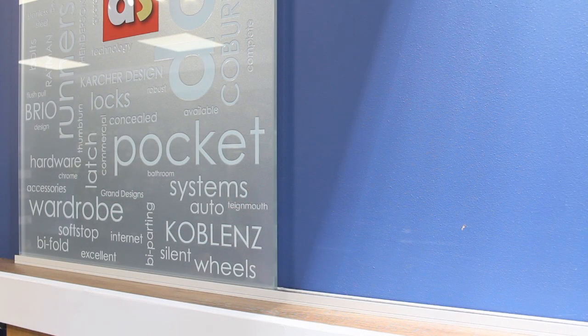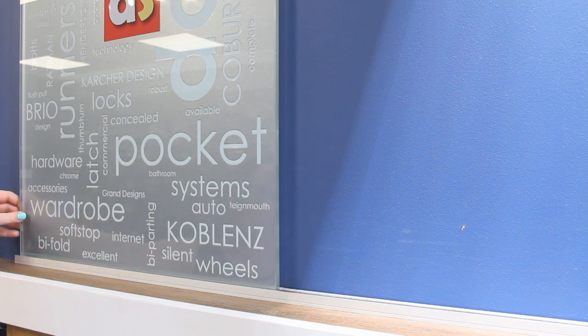This is a full-length floor guide for frameless glass doors, often used when you need the door to be guided all the way along, when you're moving the door so far that it might come off a fixed floor guide as spoken about before. This has brush strips so that it's not metal rubbing against the door, and it also is adjustable in width for 8, 10 or 12 mil thick glass doors.